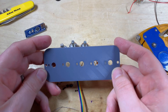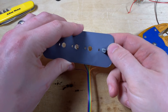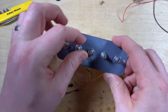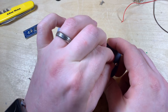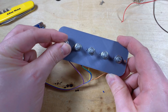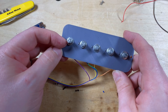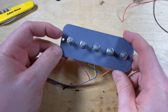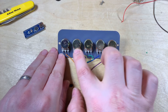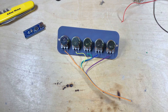I'll put them into the panel so they're all set in place while I do all the other wires. I need to think about this - I want fully anti-clockwise to be down, so that I'm turning it up by turning clockwise and down by turning anti-clockwise. Presumably then I need the lowest voltage at the fully anti-clockwise position. That means I need the ground on the right from the rear on each of these and the 5 volts on the left. So I'm going to start wiring that up now.